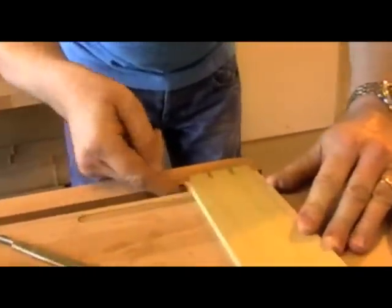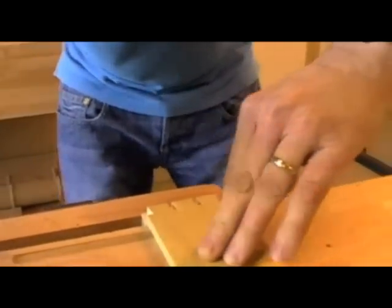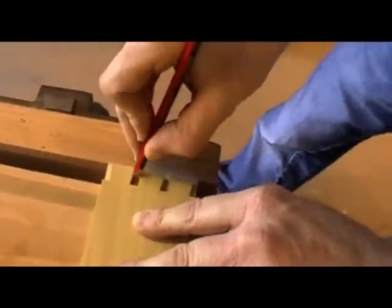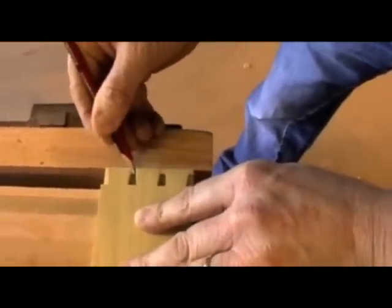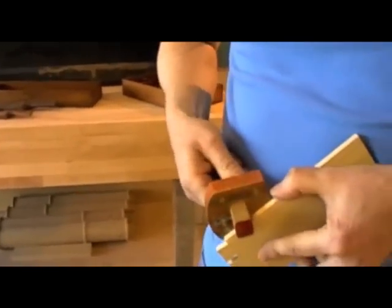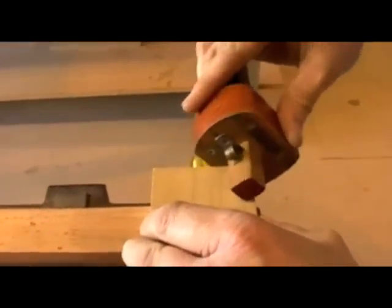I'm going to get him so he's pretty much level with my bench top. Get my tails on there, get them lined up so they're aligned at the edge and also to the shoulder line. Hold him on there nice and steady, get my pencil, get him into those corners to mark those lines up. Put my timber around — I need to now reset my gauge to the thickness of my drawer side. Tighten him up, just double checking, slight adjustment — tap on the bench. Looking pretty good. Now I need to do a gauge line on the inside of my drawer front — there's the big shoulder line.